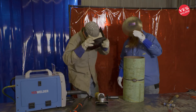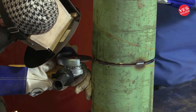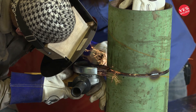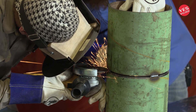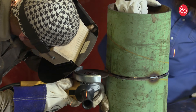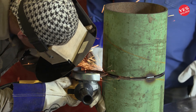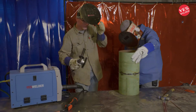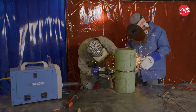Same thing — you kind of know how to do that from what you've done with TIG. It's a lot the same. Knife edge, bigger gap, nice and even. You don't want to grind through that whole tack either — you want meat to tie into. You want that knife edge on the very edge so you can tie into the edge of your bevel and then tie into that tack real nice when you come to it. Let's do the same thing with the rest of these tacks — give that a try. Don't get too much out of that bevel, just stay right on the edge. Drying that tack out.